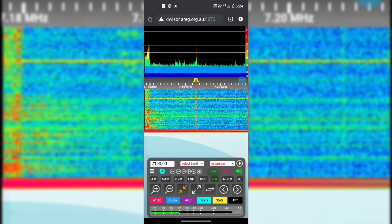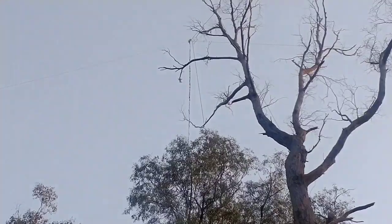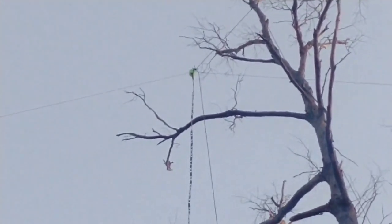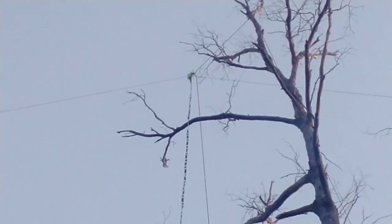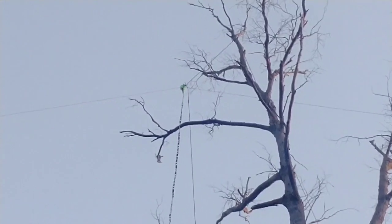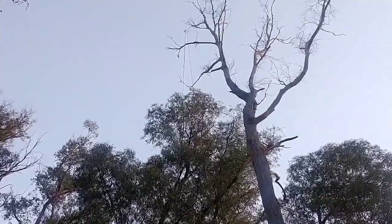There you go — that's awesome. A full-wave center-fed dipole, matched with a quarter wave of window line to bring the near-infinite impedance down to a low impedance. Don't believe everything you read on the web. Even some electronics engineering sites say that a center-fed full wave cannot radiate and it cancels itself. The real truth is it's a high-impedance antenna, and if you deal with that, you've got yourself an antenna with maybe up to 2 dB gain over a half-wave dipole. You can check that on Wikipedia.